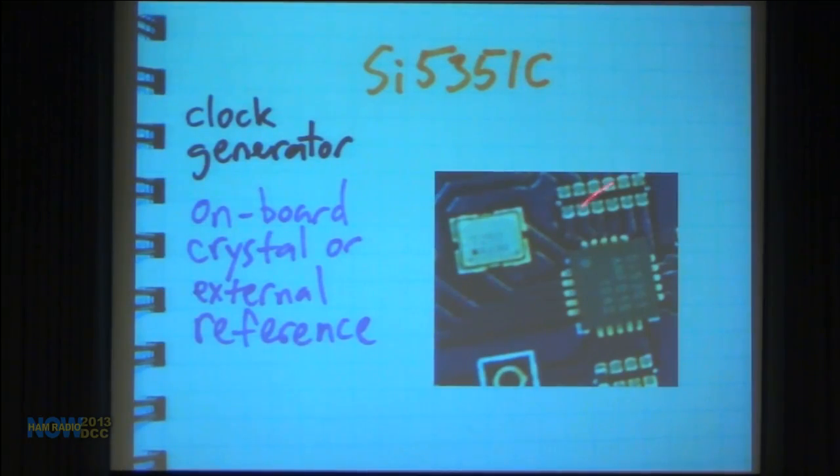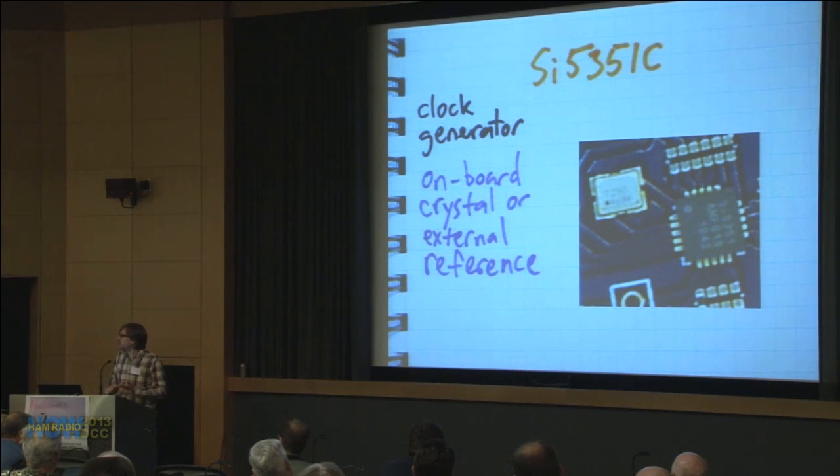You could daisy-chain HackRFs together — though not a very long chain — or have a single clock source driving multiple HackRFs. That opens the door to full-duplex operation with synchronized clocks, MIMO applications, phased arrays, and all kinds of stuff. The SI5351C takes an arbitrary clock signal frequency and spits out arbitrarily configurable clocks: reference for the IF transceiver's frequency synthesizer, reference for the wideband front-end frequency synthesizer, the ADC/DAC clock, and a doubled ADC/DAC clock for the DDR interface. Everything on board can be driven from a single clock.